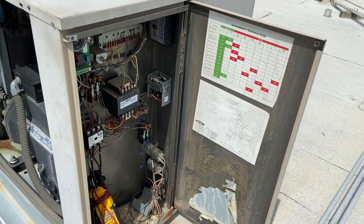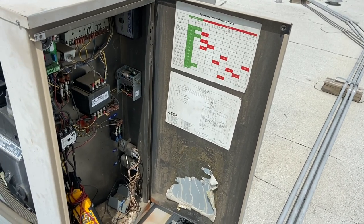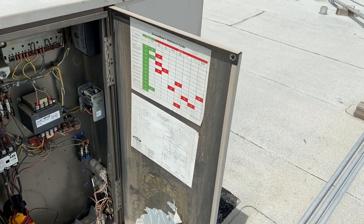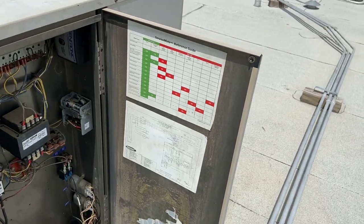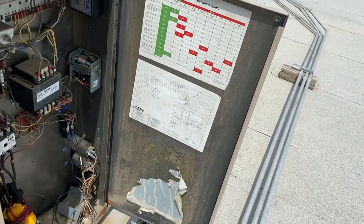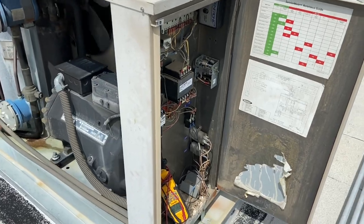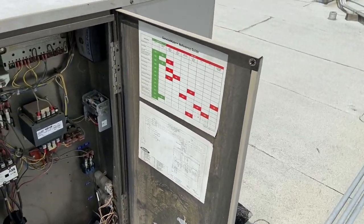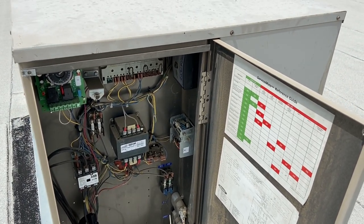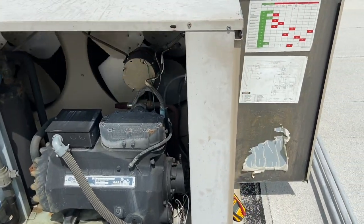Usually I roughly do 20 to 25 TD above ambient, so my high side should be about 20 degrees above my other temperature saturation-wise. I have 230 psi on my high side right now. I think my valve is bad — I pumped it down and my suction pressure stayed the same. So I'm thinking it's my discharge valve inside the compressor.